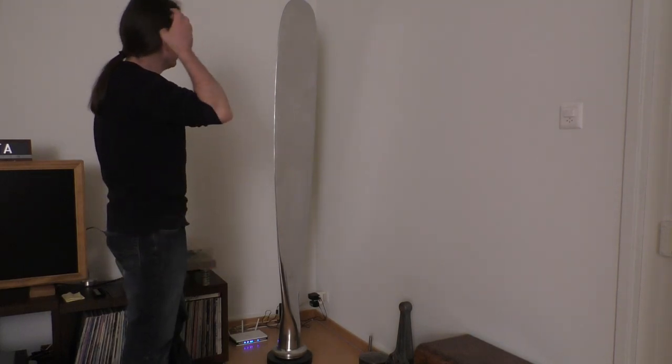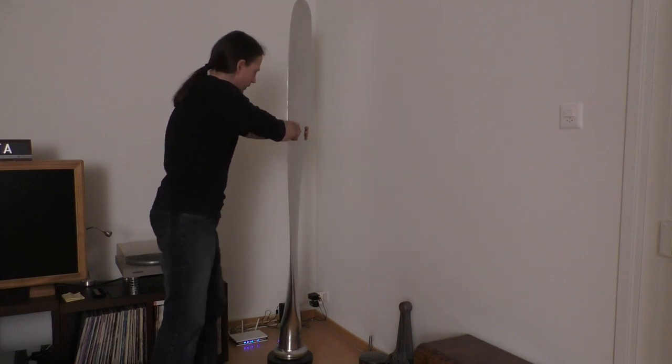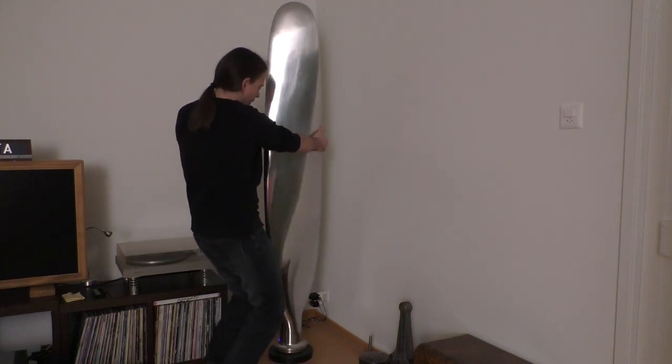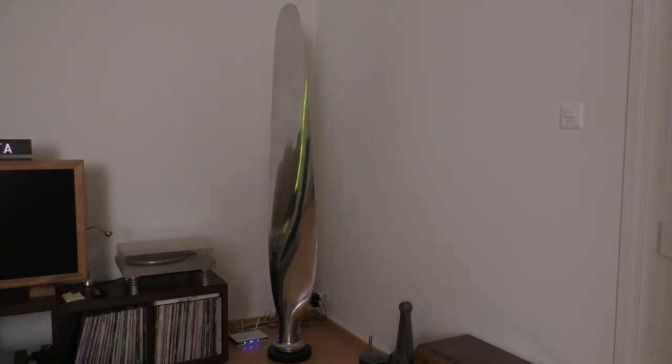And just in case your engine fails and stops turning, you will turn it like that into the flight direction to reduce drag and to prevent the failed engine from windmilling, because you have a big propeller in a fast airstream, so it will be driven by this airstream and break the engine even more, or could probably rip the engine from the airplane. And you also can turn it that way in reverse position. That's when you are landing, you have to brake the airplane down to zero, so this will help you slow down.